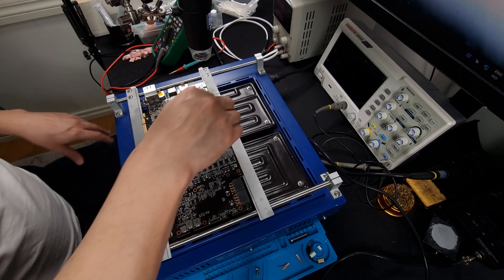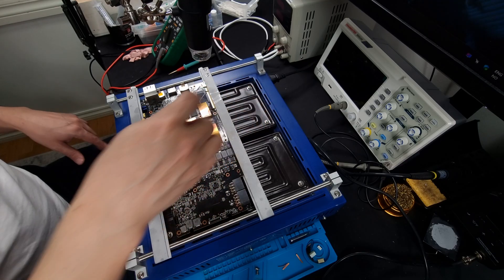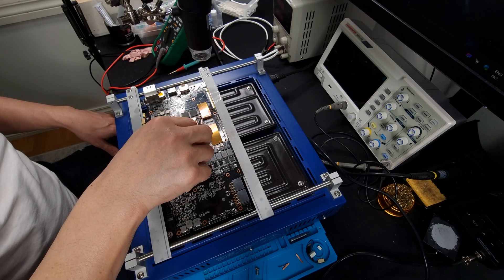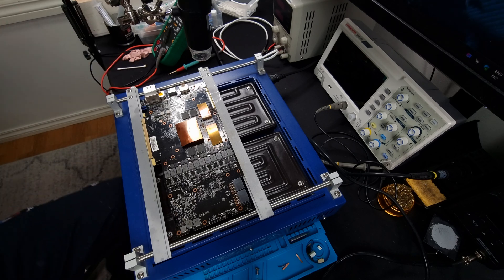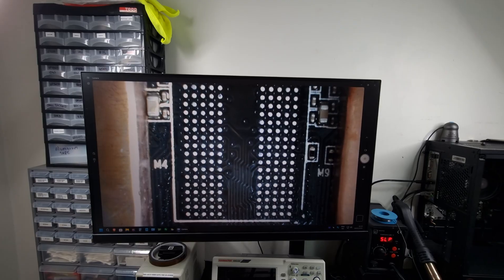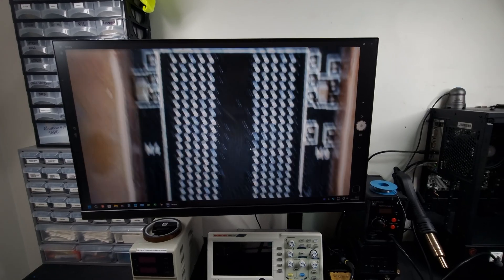You don't want to scratch the black surface or the underlying layers, because once you put your new chip on and the solder starts to melt, you'd be in a world of trouble. That looks good — going by the looks here, all the pads are in good shape. There are no cold solder joints or ripped pads of any kind.